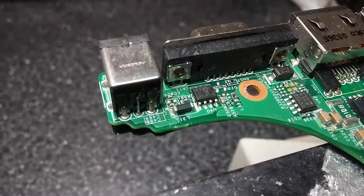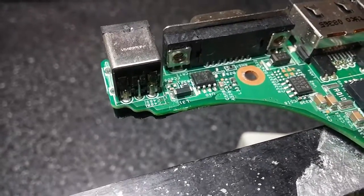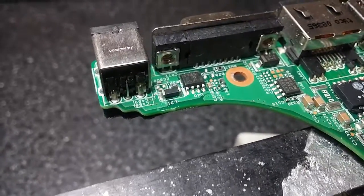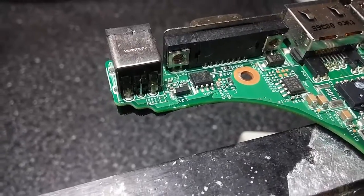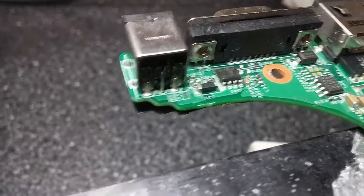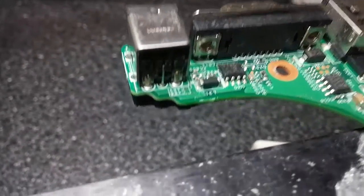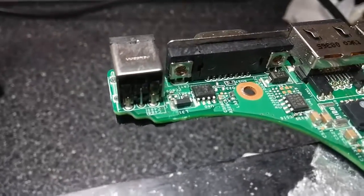So I was going to go ahead and solder this. This might actually be the big reason I see these come through — I have two other boards that are just parts because I couldn't figure it out before. That L3 is part of the fuse for the AC adapter that runs through the board. I already put some flux on there, and we'll test it and see if that fixes it.